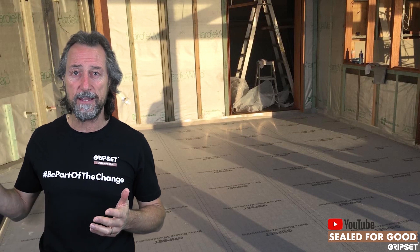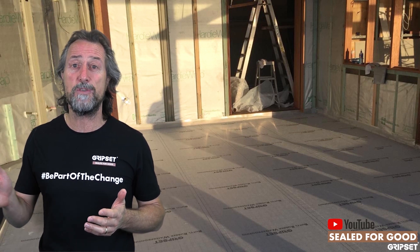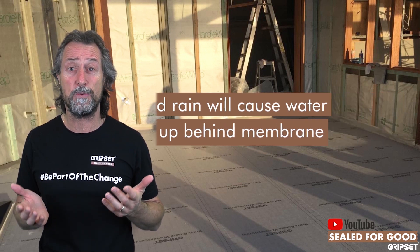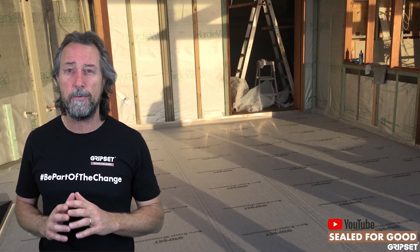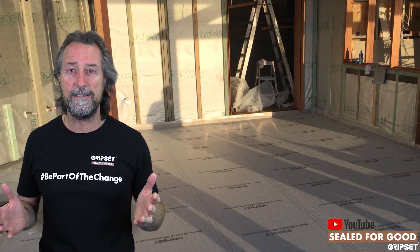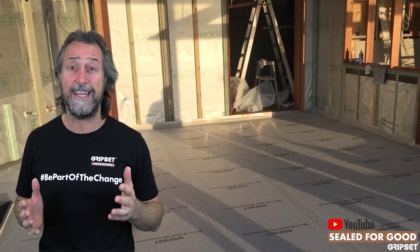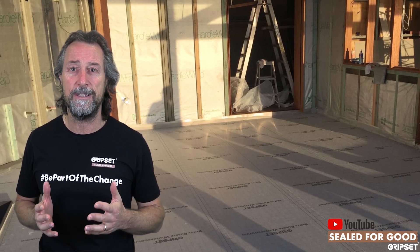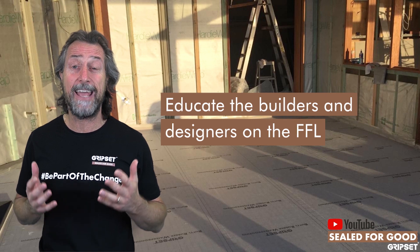From the tile finish, that's where that finished floor level is to be measured. Because when you get a driving wind and rain on that balcony floor, that's where water and capillary action gets blown up underneath those doors. Sometimes we see that getting inside the cavity and creating the leak below. I've seen people spend hours, days, and sometimes months doing flood tests on balconies trying to find where that leak is — and when they flood test it, no leak happens, but when it rains, that's when the water comes in, often getting in behind the membrane.